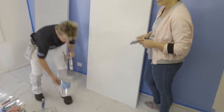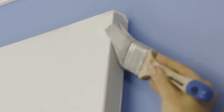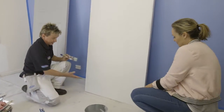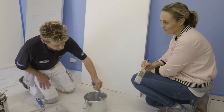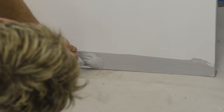First we're going to cut in our edges with the brush. Sides are done. Now we need to cut along the bottom of the door so the roller doesn't hit the floor and pick up grit. Using our good brush, just like cutting in a wall — put it on away from the edge first, angle the quality brush and let it glide. Ideally you'd have the door up on some blocks.